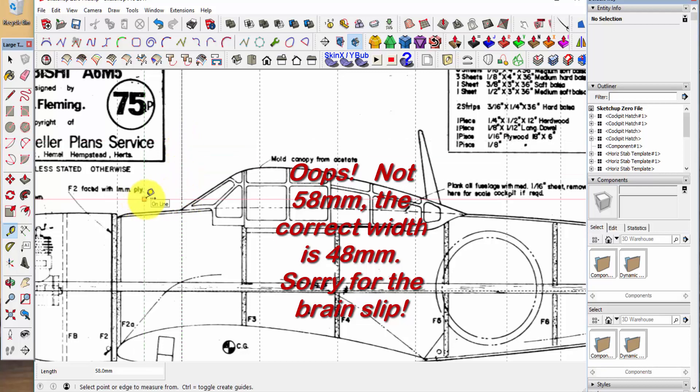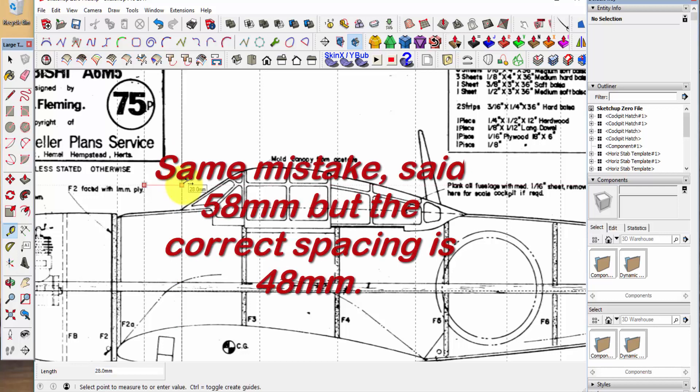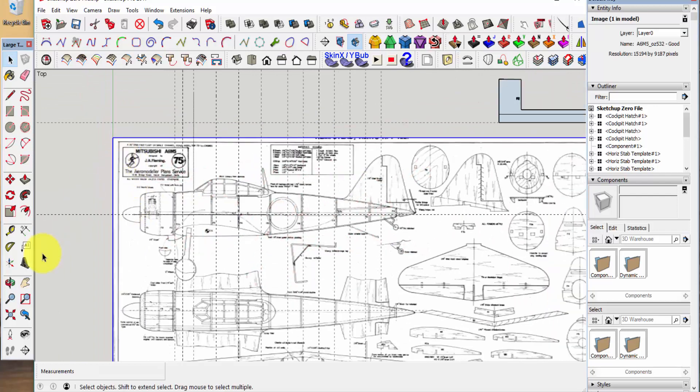This block here is going to have to be cut at 28 millimeters, and then this one at 20 millimeters. Make a note of these, and do the same thing if you're working with XPS — you're still going to end up with a couple of oddballs up front. So note that you're going to need a couple of blocks thinner than the 58 millimeters used for most of them. That's about all for SketchUp right now.